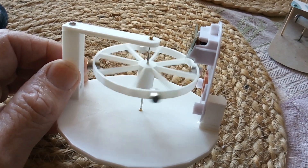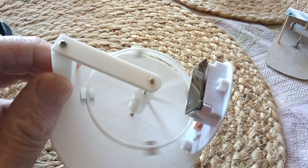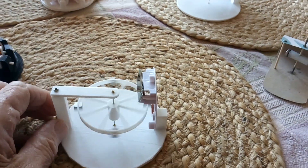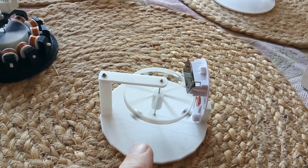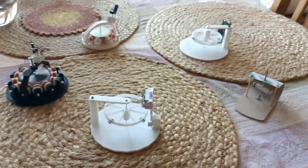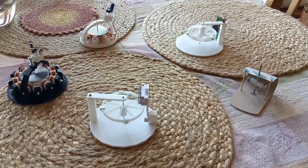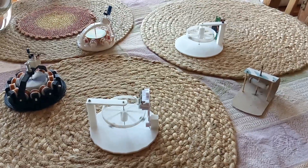Using a real quality lightweight oil with a sapphire V-bearing — what they call a Vee — this particular one is adjustable, and they come in different sizes. I got a bunch of these small ones off eBay and wanted to try them. This other one is a fixed one where you have to make your own adjustment. That's where I've been lately — looking at bearing surfaces for these long-duration running curiosity items.